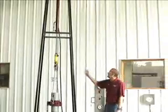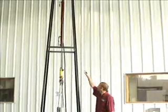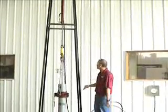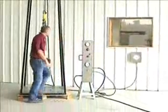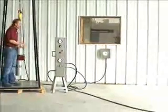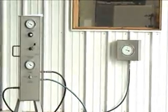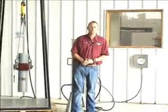When we go to lift the unit, the cylinder on the draw works — the bales and the block — would start lifting up, but the rod would stay in the same place while your connection is still screwed together. Once you get it at about half stroke, as you can see on the driller gauge, as the draw works move up you can see the needle move up. There's a set PSI on there where we would have the driller stop, so he can never over-pull and pull the cylinder in too. The cylinders are about ten times the weight you can pull up as a safety factor.